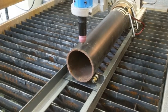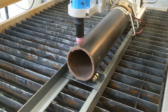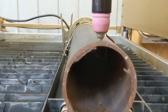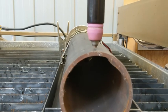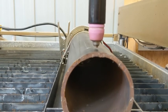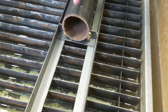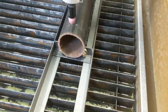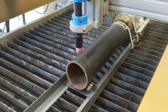We're going to run it about 900 millimeters. I don't know how fast I need to run it — it's pretty thick piping, five mil pipe. It seems to remain about 1.5 to 1.6 mil clear of the pipe. I'm not using the torch height controller for obvious reasons — there's no need to in this instance. I'll get the air connected and the plasma torch switched on and we'll see how we go. I've no idea if this is going to work, let's see what happens.